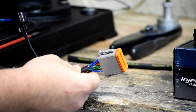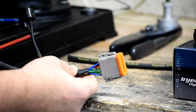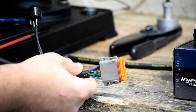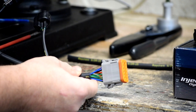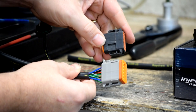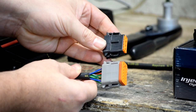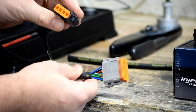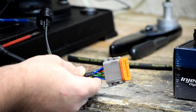One mistake I made was not picking up the difference between DT and DTM. The DT is the slightly larger connector normally used on industrial applications like mining equipment. The DTM — the miniature version — is what's normally used on race cars. The DT is slightly larger; the DTM is slightly smaller and black. It doesn't change things all that much — the DT is rated to 10 amps, the DTM to 7.5 amps. Slightly smaller end, so it's a little more compact. All things considered, it doesn't really matter.